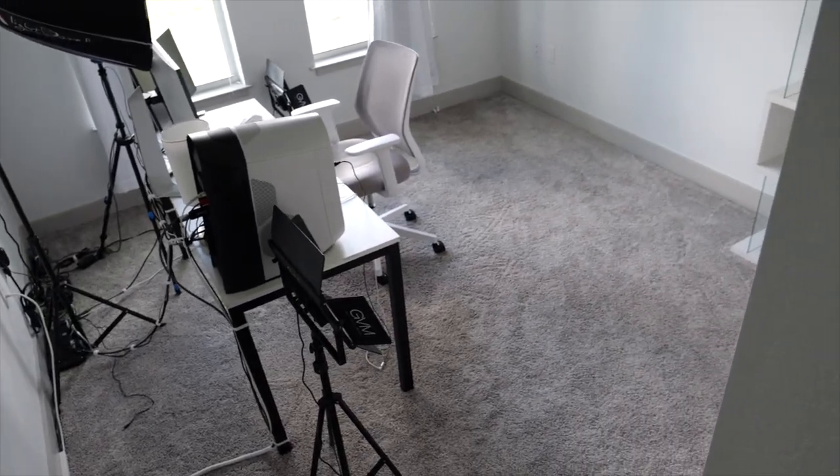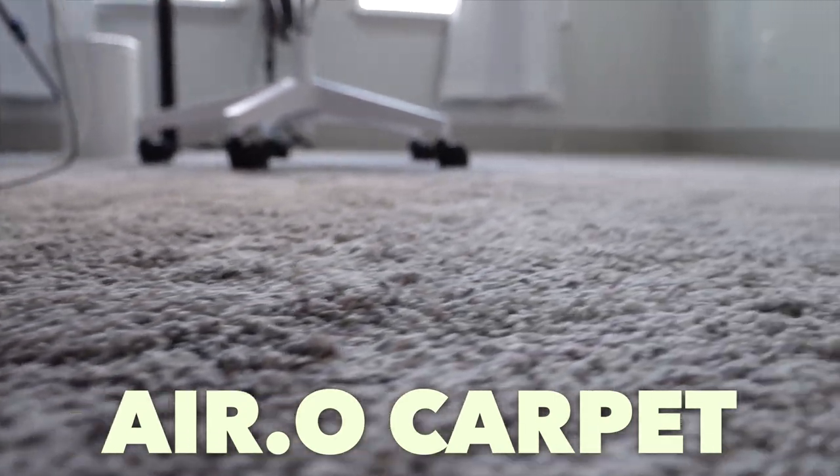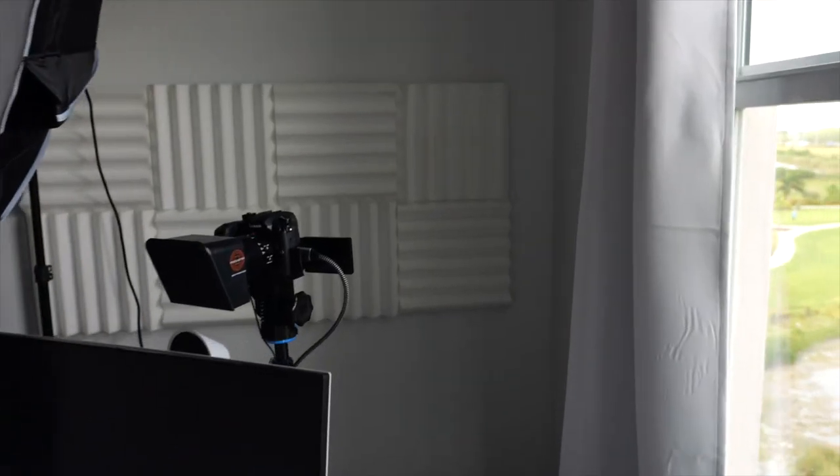When it comes to sound, one of the worst things you can have in a studio is a ton of echo. This room naturally had a ton of echo. The room originally had hardwood floors, which makes sound bounce in all directions, and the room itself is 11 by 11 feet. So I got some carpet cut to the exact dimensions and placed it on the floor — that alone reduced maybe 90% of the echo. The carpet is called an Air.o carpet, which is supposedly hypoallergenic and doesn't smell bad. Then to reduce the final 10% of the echo, I bought eight white two inch acoustic foam panels and used Gorilla Glue to attach them to a thin plastic board from Home Depot, then connected it to the wall using 3M Velcro strips.